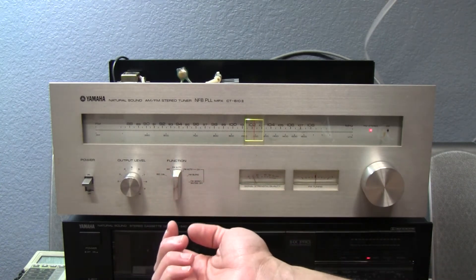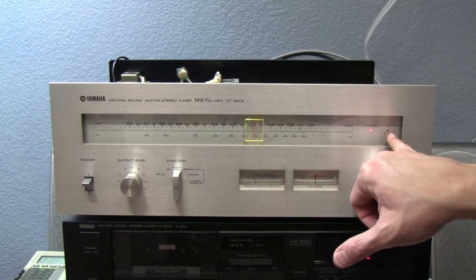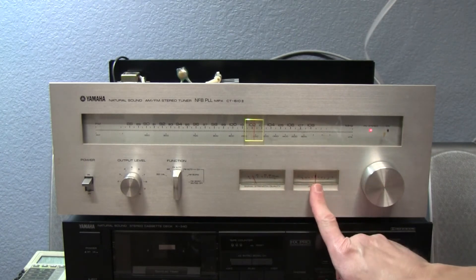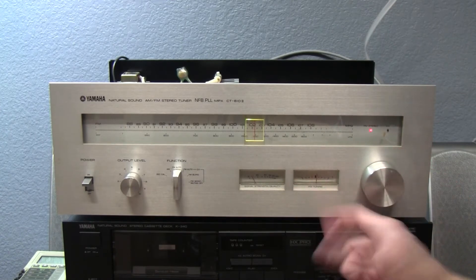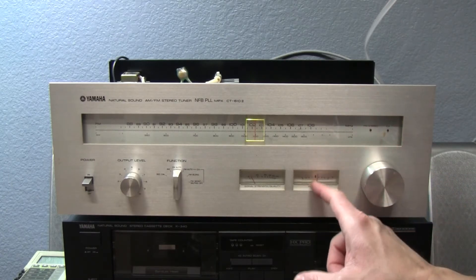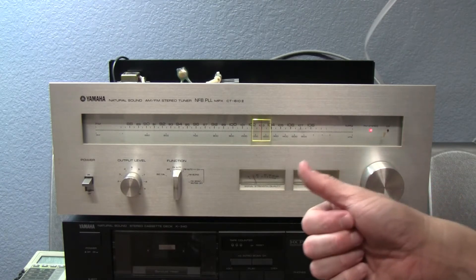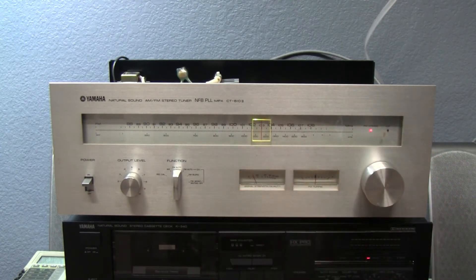And then there's the FM. The FM has a stereo indicator and also a distance indicator — it shows if you're operating when FM is very low power. You have the signal strength here, and this is the tuning meter. For FM, the tuning indicates how far along you are on the station. See as you start losing the tuning, the FM stereo loses it and then you can tell here — you've lost the station. So there are some distant stations. There you go, another station — you get all these, just kind of low because I'm trying to keep the volume low so we don't wake anybody up.